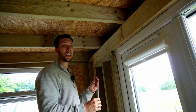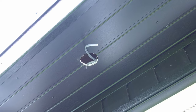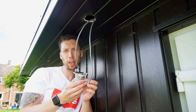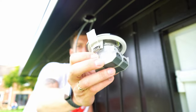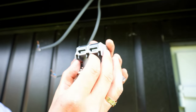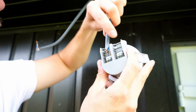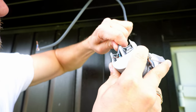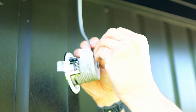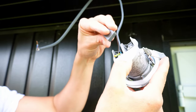Now those holes are drilled in the overhang, I can wire it up using one and a half millimetre twin and earth cable. I'm installing these Lap downlights from Screwfix — about seven pounds each, and I've already got them in my bathroom and kitchen so I know they'll do a good job. You pop out the little pieces of plastic by pinching them at the bottom, and you've got L and N to indicate live and neutral. Slide in your two cables and push them in firmly, then slide a little bit of earth sleeving over the earth cable. After speaking to my electrician, I had to go back and connect each of the earths together using Wago clips.